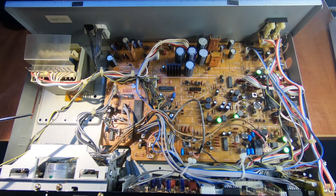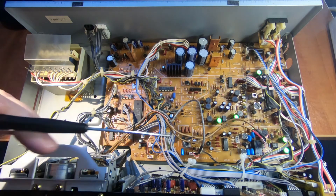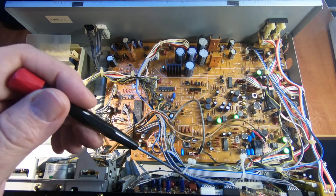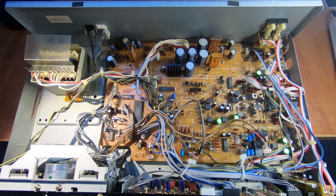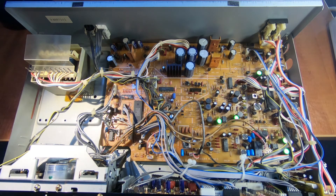It's a little shot inside — there's quite a big circuit board in this, bigger than most of the ones I've looked at around this age. I don't think it's the spectrum analyzer part, because that is on the backboard here on the back of the fascia. It's got a chip on there which I expect is doing the control for the spectrum analyzer, so this all must be just tape mechanism. It's all through-hole components — and I say of course, 1988, there was quite a bit of surface mount around at that time, but this is all through-hole. There's quite a lot more than I would expect for this deck.